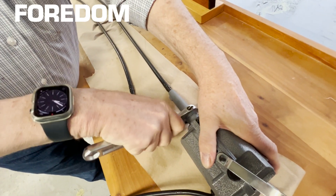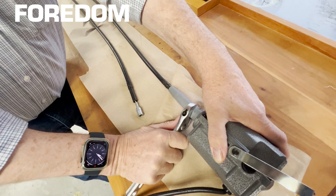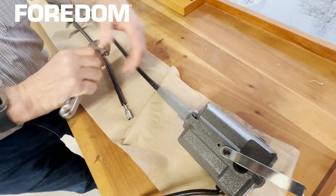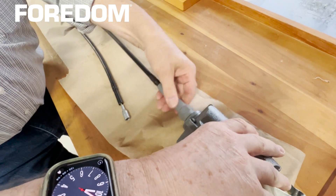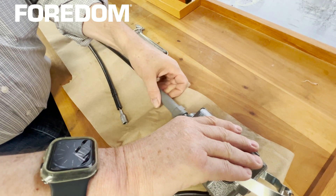Put it over the motor connector and loosen it. Remember, it's got a left-handed thread. The newer motor connectors will have an arrow to show you which way to go. Remember to unplug your motor first before you do any of this.